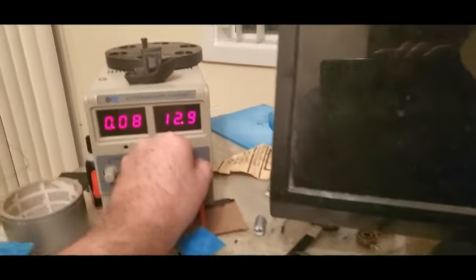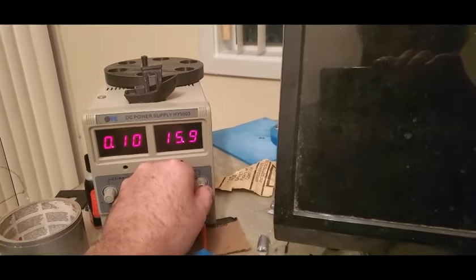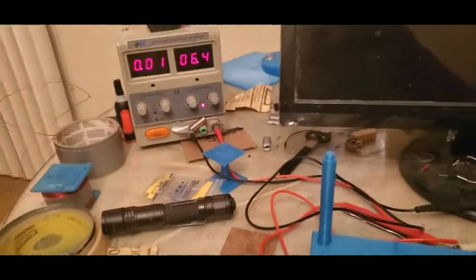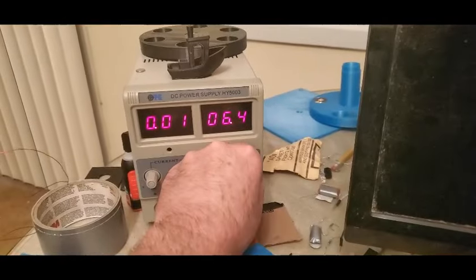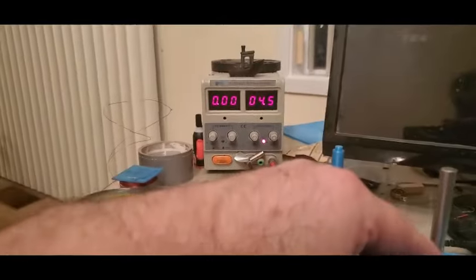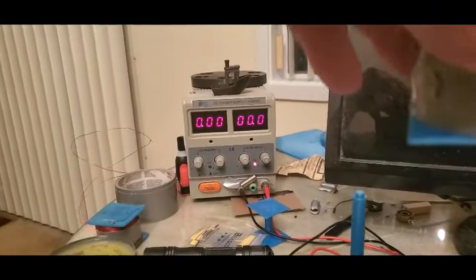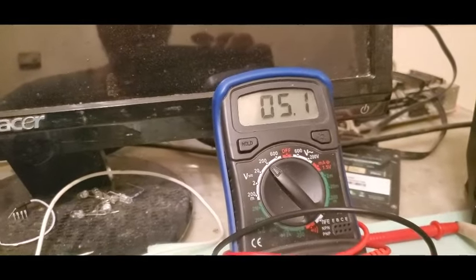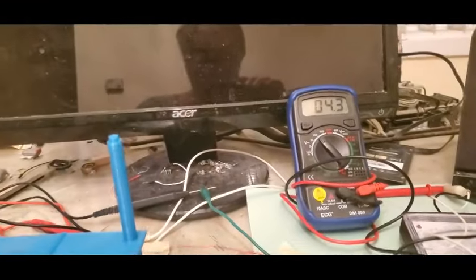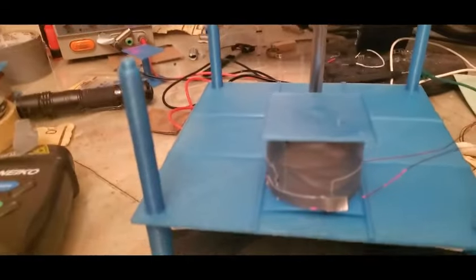So let's crank it up here for a minute just to get it spinning again. And then just to show you that I am doing what I'm saying I'm doing. So, you can say, well, you're not really turning that all the way down. You're just turning it halfway down. That's why it's reading 4.8. Okay, so maybe I can show both of these at the same time. And I lift this up. Boom, 0. Boom, 0. Put it back. Boom, 2. And we were spinning faster. Nothing. Back EMF. And some of that back EMF goes along with the collapse of your inductive spike out there.